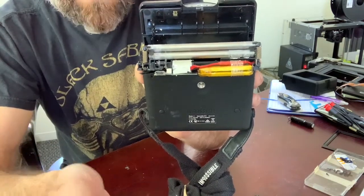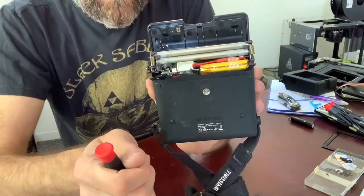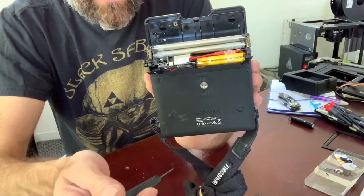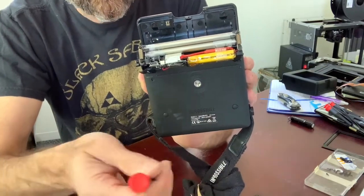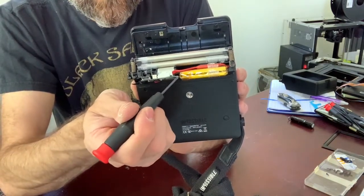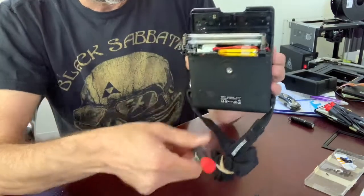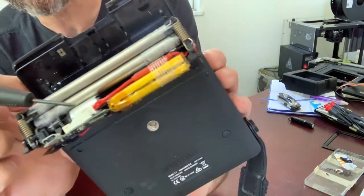As you can see, the battery is located right here. It's a sandwich of two 500 milliamp LiPo cells in parallel, so each of them is 3.7 volts. The sandwich is still going to be 3.7 volts but you have redundancy — in principle it's a 1000 milliamp 3.7 volt sandwich. Each of these cells has a protection board built in for over-discharge and over-charge protection.